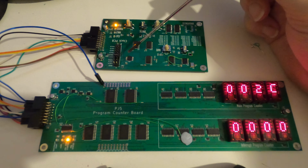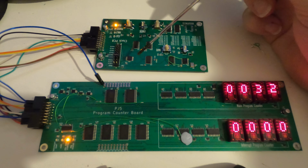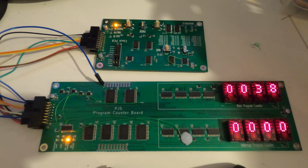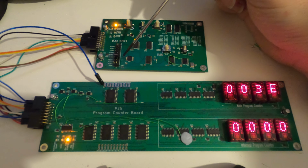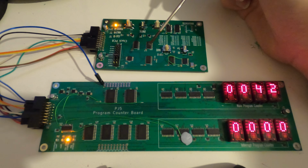There is a delay here, a Dallas chip that gives me delay in increments of 50 nanoseconds up to 500. This gives us our second phase of the clock. So the idea is that the program is loaded on the first phase and executed on phase 2, or second phase. I'm hoping we can get down to 50 nanoseconds, which then means we can run at like 2 megahertz, 4 megahertz.